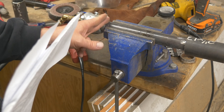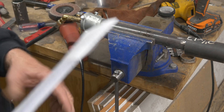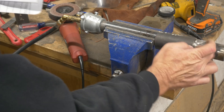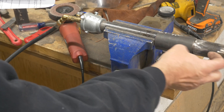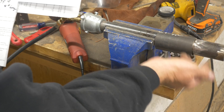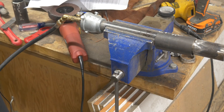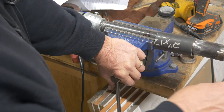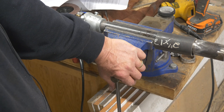This piece of pipe here has a two-inch OD and a one-and-three-quarter-inch ID, and it's four inches long. This piece of metal right here has a 1.66 OD and a 1.37 ID — so probably one-and-three-eighths on the inside and one-and-five-eighths-ish on the outside. I picked this up at a scrapyard today for less than ten bucks. It would have been four bucks if I'd found it used, but either way, ten bucks to retrofit this burner to fit better in my furnace — money well spent.